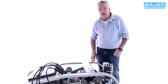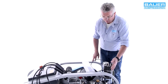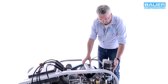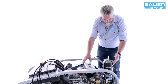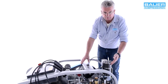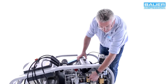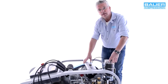When the system is not in operation, the microfilter should always remain pressurized. You can check this from the manometer, which shows residual pressure in the microfilter. The filter should be pressurized at all times when the filter cartridge is in use and is not yet saturated. The filter housing should only be depressurized to atmospheric pressure when the cartridge is changed. Use this air bleeder valve to depressurize the microfilter housing. When you have done this, you can change the cartridge.